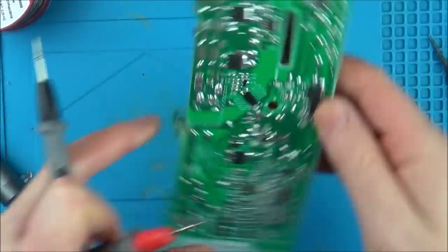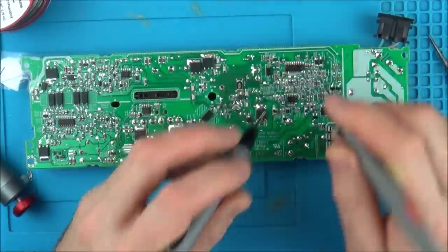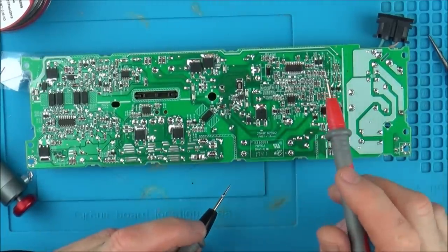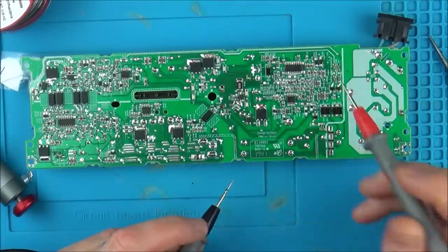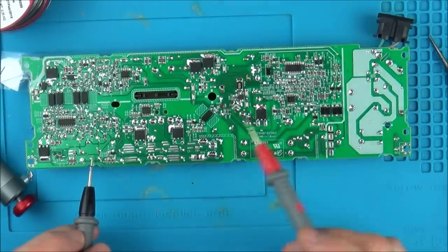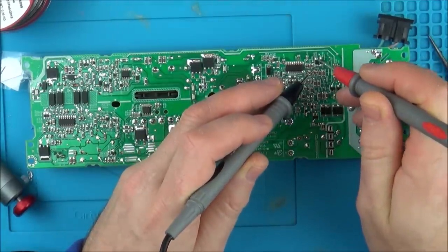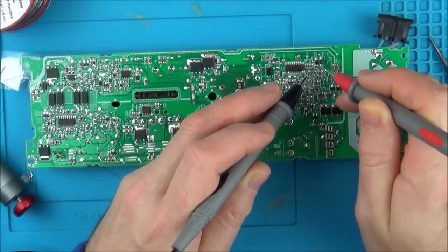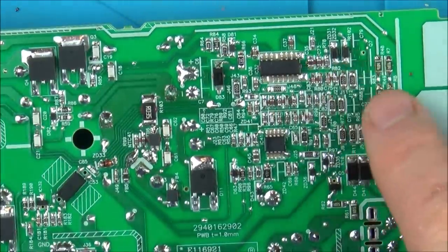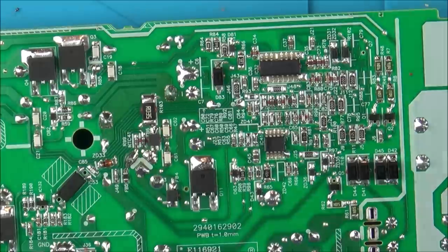Let's see what's happening with this diode now, because maybe there are numerous things wrong. That diode is still shorting even though the bridge rectifier is out, so that says to me it's not just the bridge rectifier at fault. Shall we take out the diode and see? If I put the bridge rectifier back in and something else is shorted, it's just going to blow things again. Let me see if I can pop this particular diode out and check if the pads are shorting — if they are, it might be the controlling chip or the diode itself.